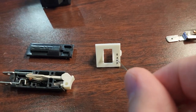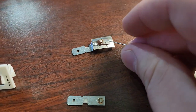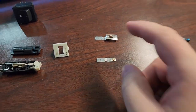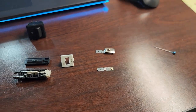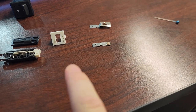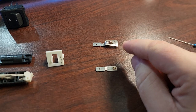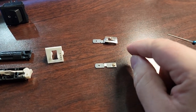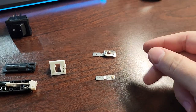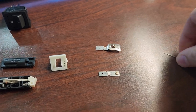The amperage rating is specifically related to this spring-loaded mechanism that is inside the device. Now let's get back to the fundamentals. When you have a metal and you pass electrical current through it, that metal is technically a resistor. The more current that you throw through a metal, the more resistance it's going to experience. And more resistance means more heat it's going to build up. That is the principle that this breaker operates off of.